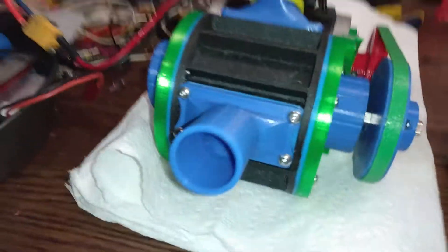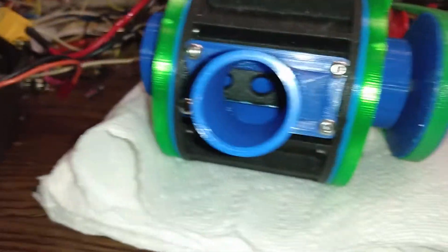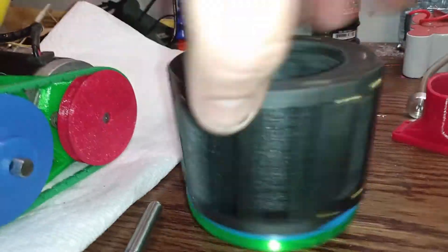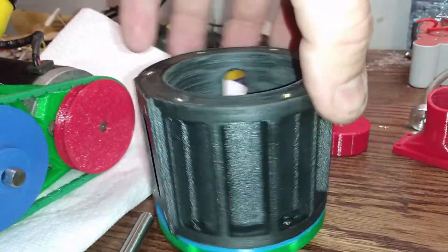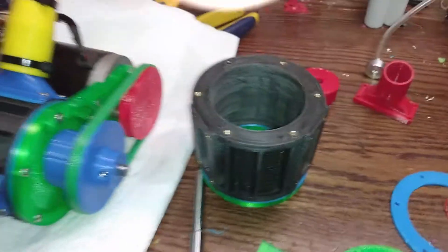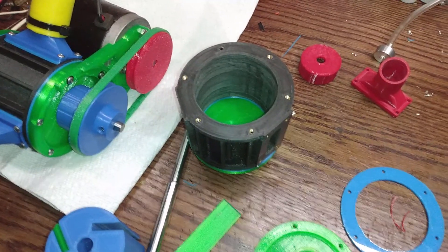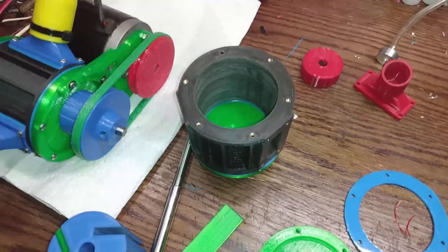The original version of the pump has a smaller set of ports on the inlet and the outlet compared to this one, which seems to contribute to noise. I had also stiffened up the webbing, put my logo in, and stiffened the whole thing up top to bottom. I also added heat-set nuts to increase the longevity and sealing.